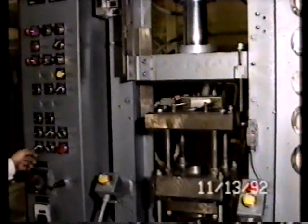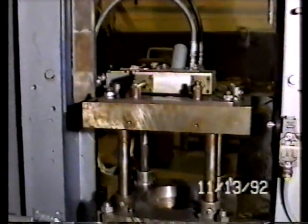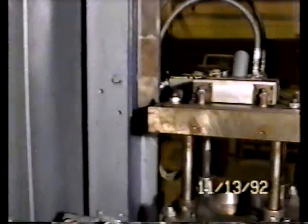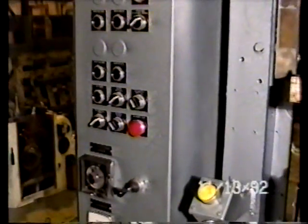We have the press in the automatic mode right now, and we've added a dwell timer to the powder feed tube to hold it forward longer, over the die cavity, then the die cavity raises, causing powder fill. Now we've set a timer so that for an adjustable period of time, we are jogging the powder feed tube before it goes back. These are all selections, a lot of variability. It's described in the Bussman Simetag brochure.